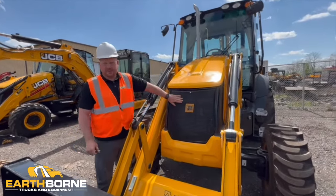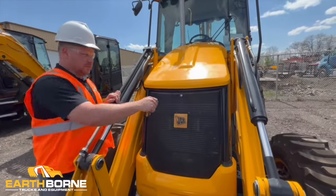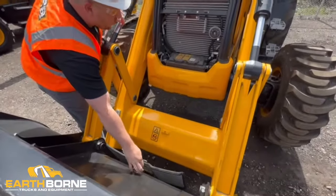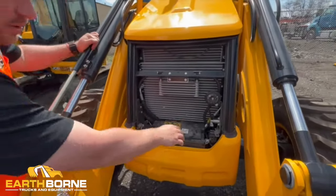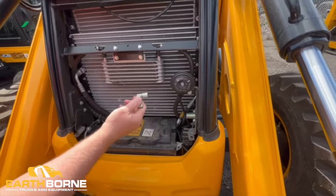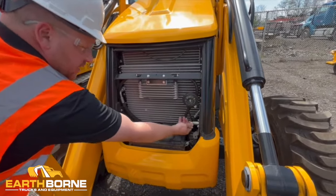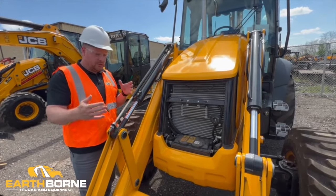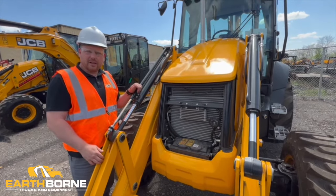We'll start around the front. First off we have the grill. You're gonna take your JCB key — the same key that opens the door and starts the machine in the ignition — you can pop the front grill off using that key, and inside here you have easy access to your battery. You have your battery isolator switch. Just a quarter turn to remove. You can take this with you or leave it in the machine, but this cuts off all the electrics to the machine. Good to use when you're letting it sit for a little while, or if it's super cold and you have a drain on the battery.